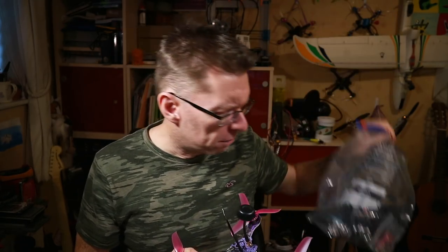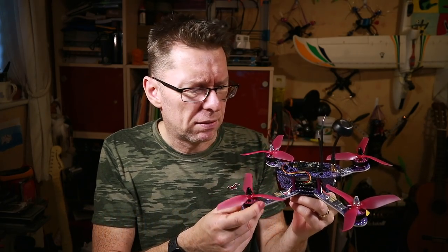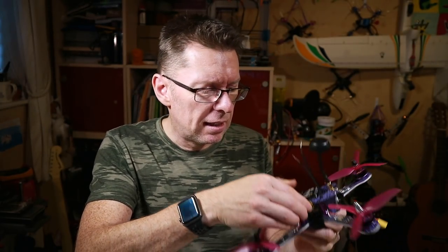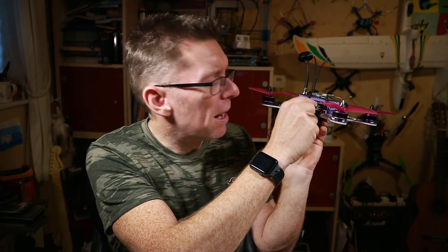The MXP230 is currently residing in a bag of bits. Hence the X4R receiver on board, mainly because I'd run out of XM Pluses. This is now a bit of an AKK quad with the flight controller, the VTX and the antenna all AKK. It was quite interesting putting this inside because I was confused about why they've removed the RF shield from the original VTX. I think it's because the design of the quad leaves so little space — the purpley thing is actually touching the heat shield of the VTX, which isn't a great idea. But it's held in securely.